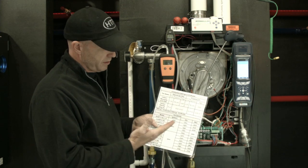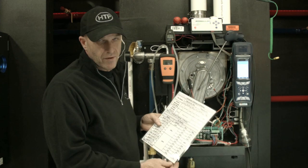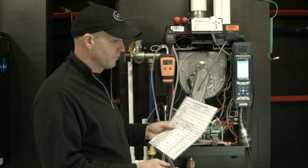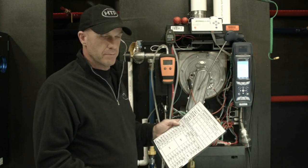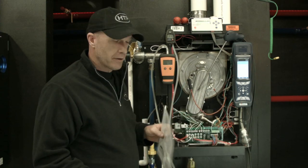From the manual provided with the boiler, I've printed out the information you need to do this. This is the layout of the gas valve, which shows you the inlet ports, the outlet ports, and your adjustments for all the models. This is going to be important as we go through this to review the actual combustion levels. This is provided in the manual or the app on your phone, and certainly a laptop. You'll want to have this with you so you can reference ignition speeds, where you need to be, and the appropriate combustion levels.